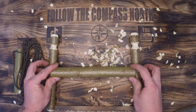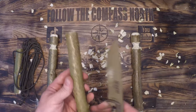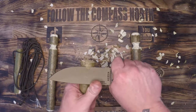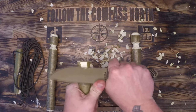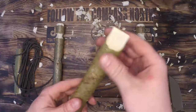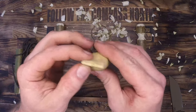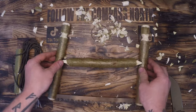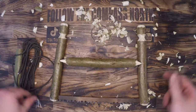This next piece is a little more critical than the uprights because its length will determine the stability of your saw. If it's too long your saw will rack back and forth too easily, and if it's too short you're going to have trouble creating enough tension on that blade to make it usable. It's also important to make sure that when you're carving these they line up with each other and you don't have a twist, because that twist would reflect directly into your saw.